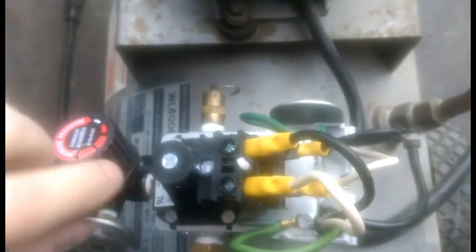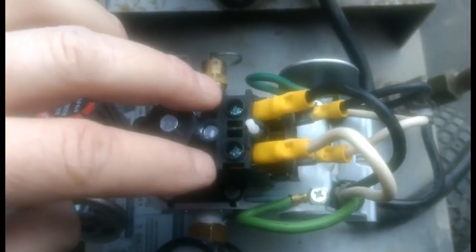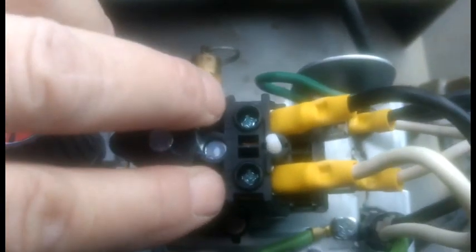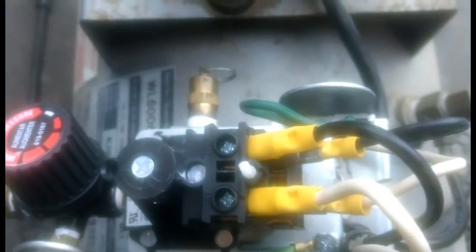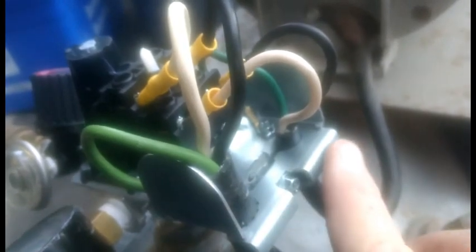I've got terminals installed on the wiring. Different switches are a little different — the wiring diagram I have shows the top terminals are for the motor and the bottom terminals are for power in. But according to the body of the switch, right below my fingers, it says 'line' for both of them, so to me that's power coming in — your big cord — and power going out to the motor is the two small wires on the bottom. Make sure you bring both cables up through the clamp; there's a small hole and a bigger hole. Run your cables up, tighten it down, and you're good to go.